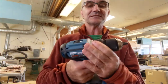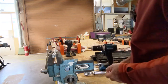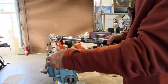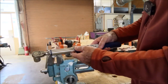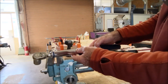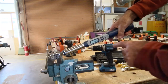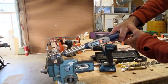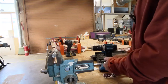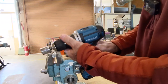I'm really curious to see what the actual torque settings on these clutch positions are. I'm going to use this torque wrench and tighten a nut to about 5 foot-pounds of force. I'll set the torque wrench to 5 foot-pounds and crank until it beeps — that's 5 foot-pounds. Then I'll put a socket on the drill driver, set it to the lowest clutch setting, and see if it can take that nut off.